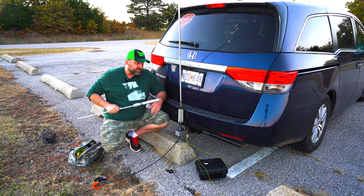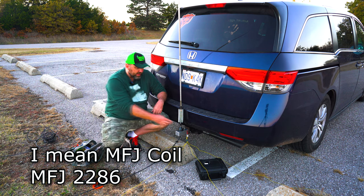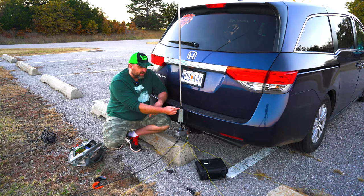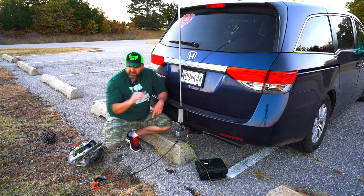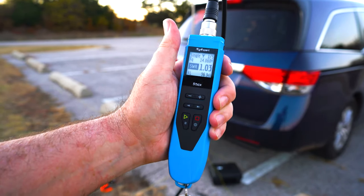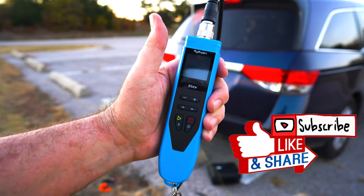What I did get to work was this MFJ antenna — I'll put a link in the description. I experimented going all the way up, and I almost got it shorted out completely. But this coil I have all the way up to the top, and I've got a low SWR. Now I've got four radials. This is 20 meters — we're talking about 17 feet, 17 feet, 17 feet, and 17 feet. And check it out: 1.03 SWR. It's very good SWR — I'm very, very happy with that.